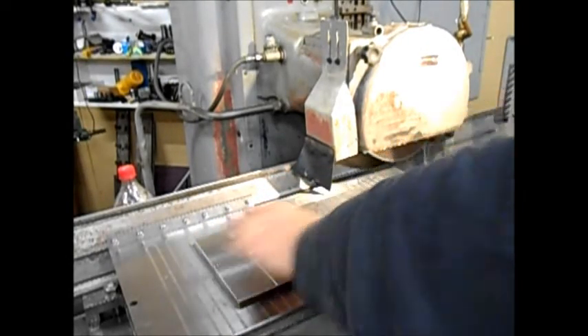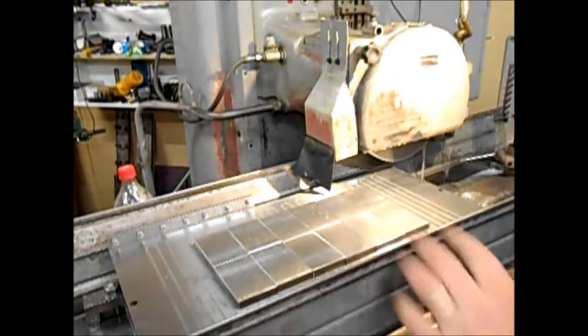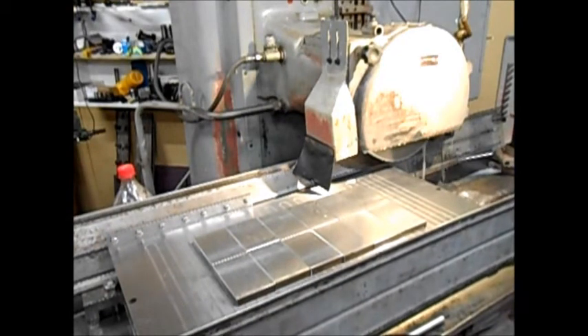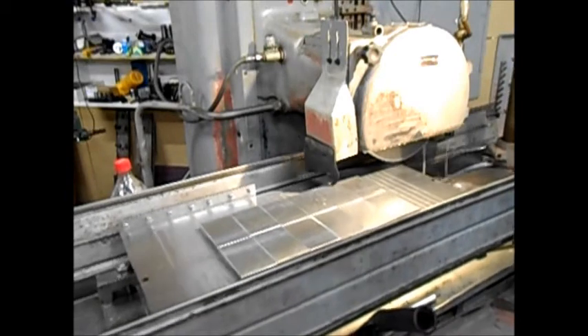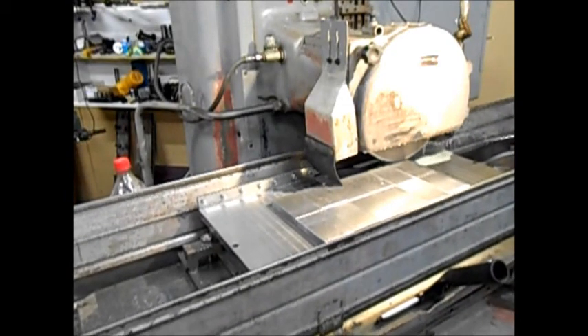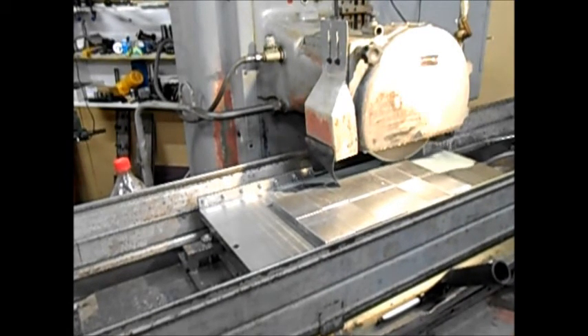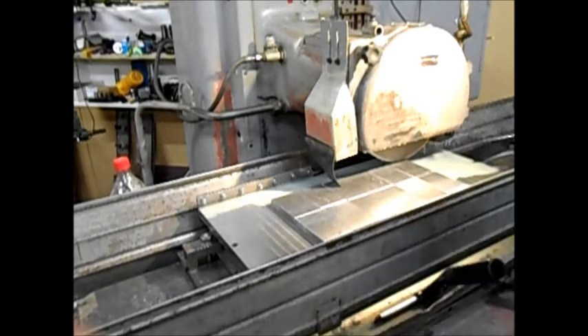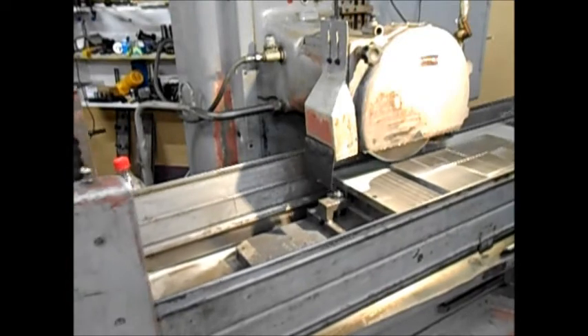We're set up there. Just remember to clamp them down. You'd think I could just run the machine over at the same setting, but I'm always wary of that — I've actually done that before and had it take a bit too much off. So always check beforehand, even if it's just a manual check, to make sure nothing's going to happen. Looks alright.